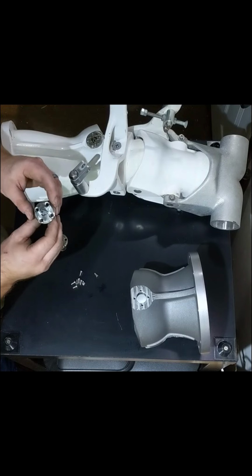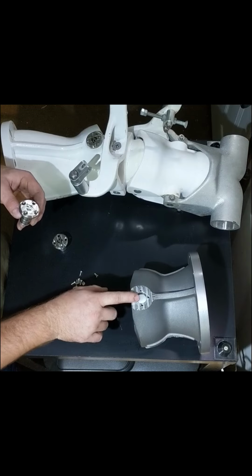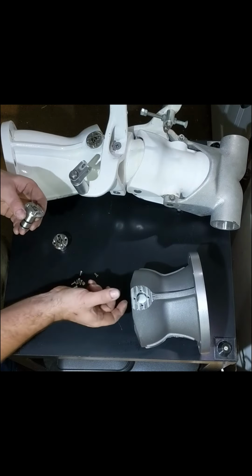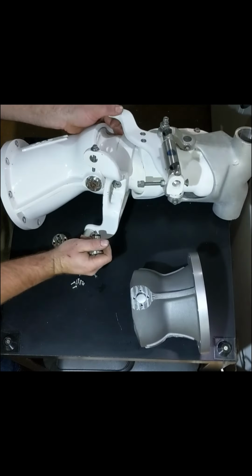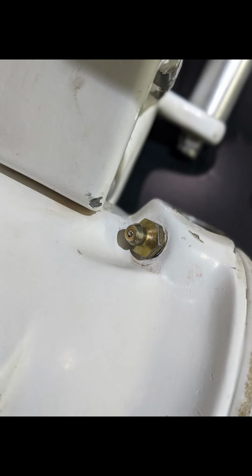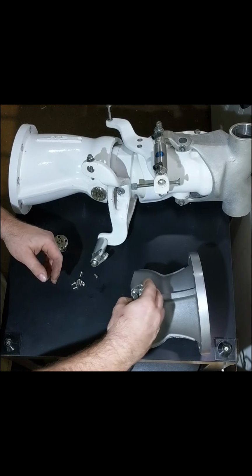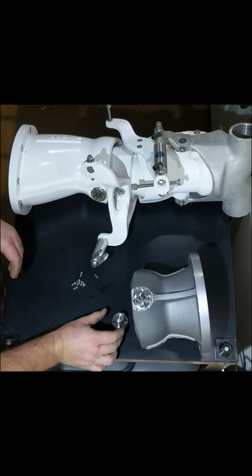The idea here is that you eliminate the nyliner, which normally would go in here in your droop or your nozzle adapter, the straight pin and the cross bolt, which would go in over here. So normally you'd have a bolt right here, where I now have a zerk. There's two of these pins for kind of obvious reasons. One on the top, one on the bottom.